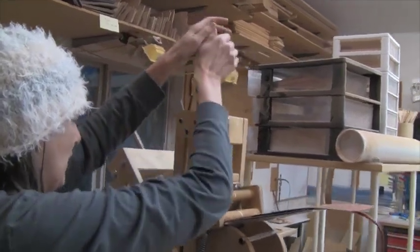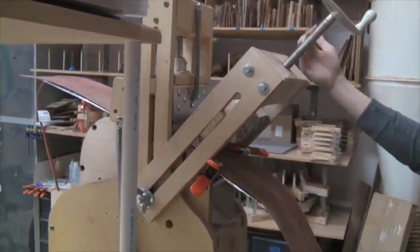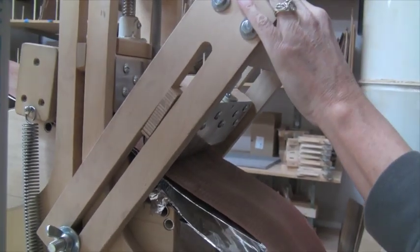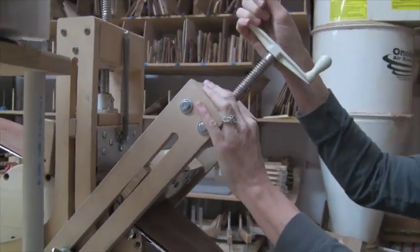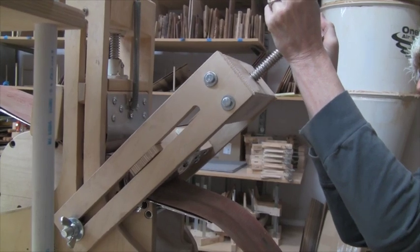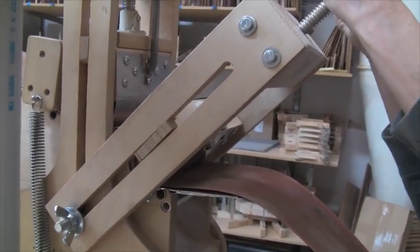The first thing I'm going to do is bend the waist, so I just slowly spin that down. Now the ram for the cutaway actually kind of started falling forward, but I like that because it's just very gently going to start introducing that curve — my clamp stopped it anyway. So now I just start applying the pressure from the cutaway part ram here, and I just ease it in gently, slowly. Hold my breath a little bit. Just kind of let it rest. I'm going very slowly because I don't want to crack the side or the binding — just very easily and gently introducing this pretty severe curve.